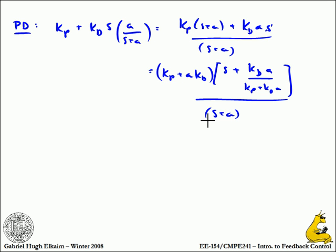If I look at this in the complex plane, what this means is I have my 0 first, my pole farther down. And I'll get to why this is called a lead slightly later. In a real-world system, that's just equivalent to sticking a filter on your sensor? Yeah. This is sticking a low-pass filter on my sensor.